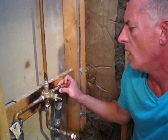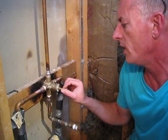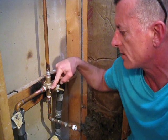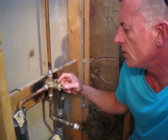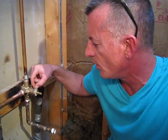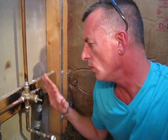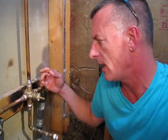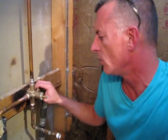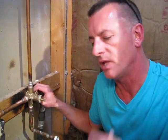The Moen product I thought was really pretty cool. When you apply heat to this device — we've got the copper pipe and a brass control — there's just a little clip, and what you do is pull the clip out and you can remove the plastic and rubber controls out of the brass, then heat it up without causing a problem. After it's cool, you slide it back in, the clip goes down, and you can turn the water on. It's really easy to do, nice stuff to work with. It is pretty pricey, but you get what you pay for — and that's definitely the case here. So that's the plan, thanks for watching.